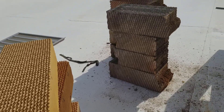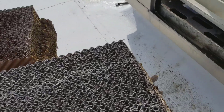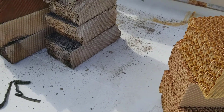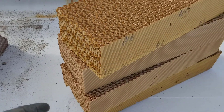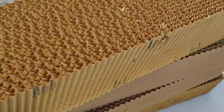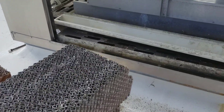I believe they use the prop fan because it is a heck of a lot quieter than a squirrel cage style. These old units basically get made into concrete — one guy couldn't even carry two of them by himself with all the minerals and calcium built up. But you can rope new ones up over the rooftop like nothing — it's like pressed cardboard. They're cinder blocks after they run a few years.